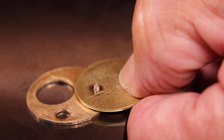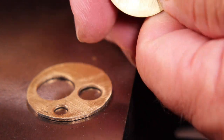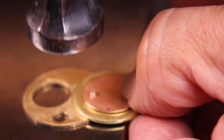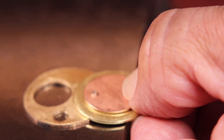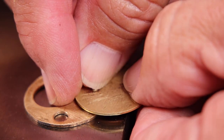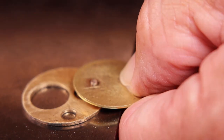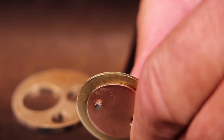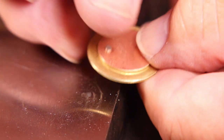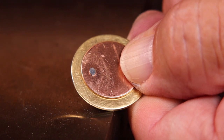If you're using a straight rivet wire, put a spacer in between the block and the back piece of the metal. This will help keep the one millimeter length nice and straight. Keep your metal straight up and down, hammer lightly on one side, then flip it over and repeat the process. This will help keep the custom wire from bending over — it'll keep it even on both sides. Tap a little bit on each side, keep flipping back and forth. I am using the planishing hammer with the slightly flat head — I don't really need the ball peen or cross peen hammer on smaller rivets.